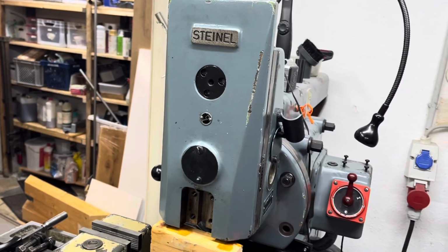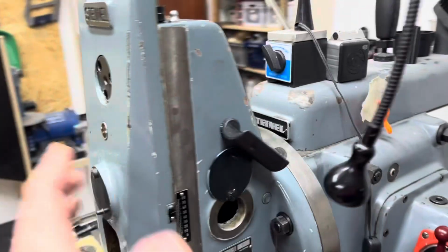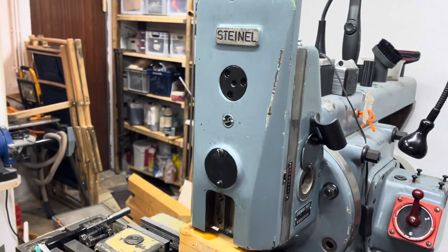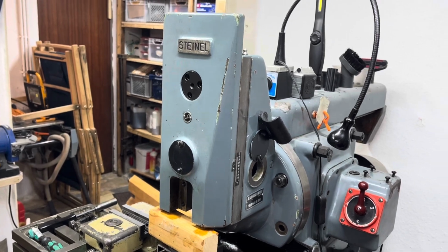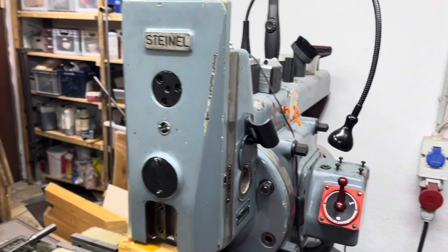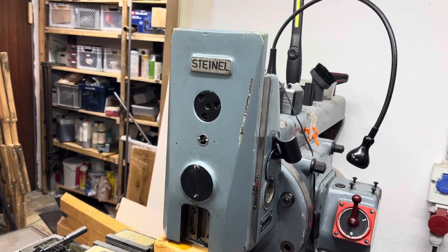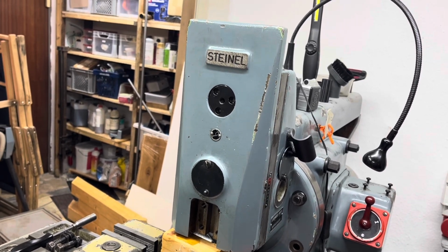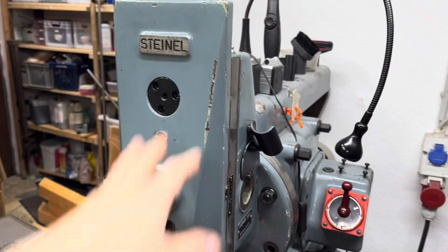This worked. I moved the mill by hand a little bit up and down while pressing on it, and then with the motion friction was reduced, and then it was sliding right in. So no force, but very gentle movements, and now it is back in place again. It was a matter of, I would say, 10 minutes. That's fine. The gib is not too tight at the moment. We will do this later.